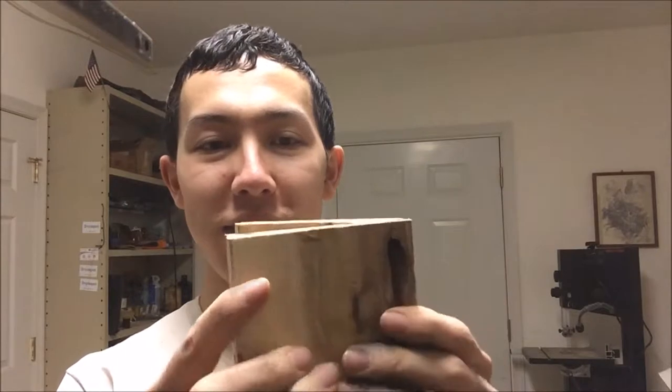Finished cutting the sides into the pieces that I want. I ran into a bit of an issue. The fence ended up not being tightened down enough, so as I was using it, the fence would sort of slide gradually, so my pieces were getting bigger and bigger and bigger. I found that and I rectified it, and now all my pieces are roughly the same size.